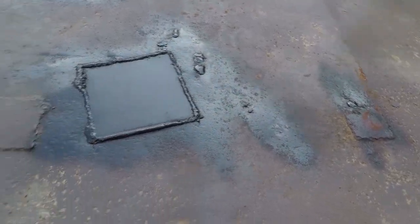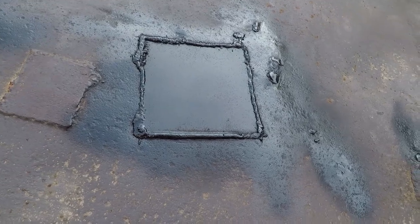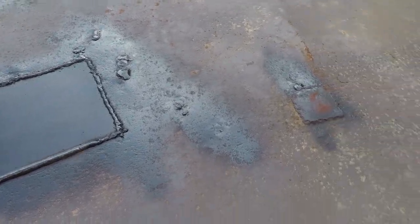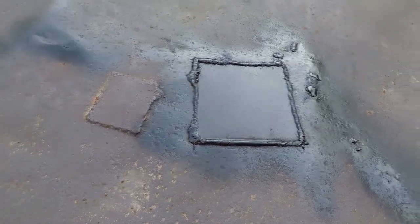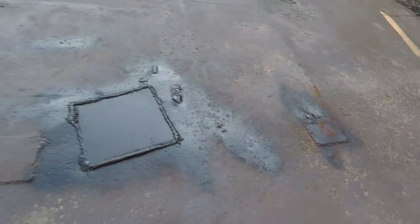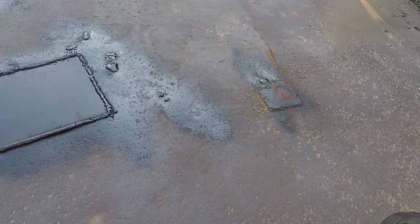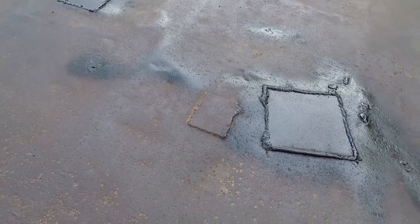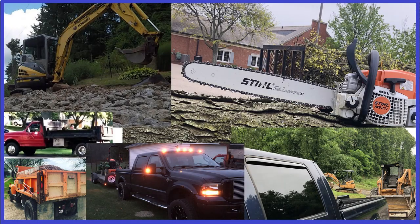Alright y'all, well, I got it patched in. It's definitely not pretty, but at least I won't have big chunks of rock falling out of the bed whenever I'm hauling. It definitely needs the floor replaced — it kept burning through because it's so thin. So if I'm going to keep this as a dump truck for next year, over the winter I'll probably replace the whole floor and the sides of the bed. I tried patching up some of the small holes and just made things worse, so the rest of these little pinholes I'm just going to leave for now. If they get any bigger, I'll put another patch on. That'll do for now. I'll see you soon.